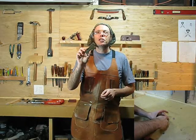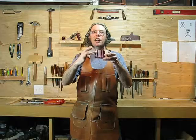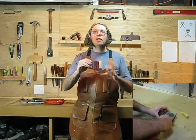Now with all these hand tools, you're going to need a way to keep them sharp. There are a lot of different systems and people will tell you different ways to sharpen — I'll probably do a sharpening episode one of these days. But what I use most of the time is just an ordinary Arkansas whetstone. As long as you stop as soon as the tool starts to get dull and give it a few swipes, they'll stay pretty sharp and you'll hardly ever have to re-grind them. Then I follow that up with a slip strop — it has leather patches and profiles in the wood. You put a little abrasive on there and you can touch up all the edges and get them crazy razor sharp. Also useful for carving and for your bench chisels.